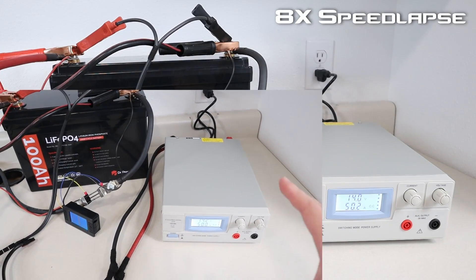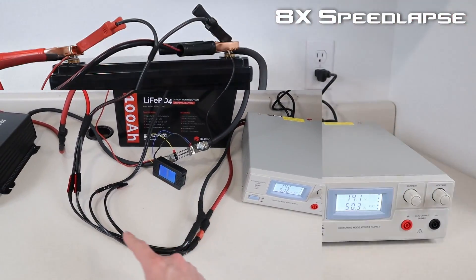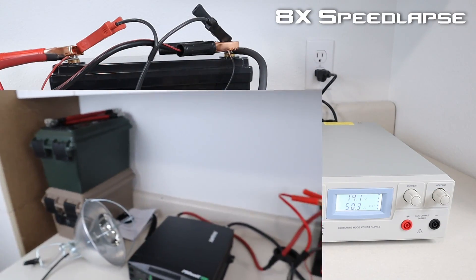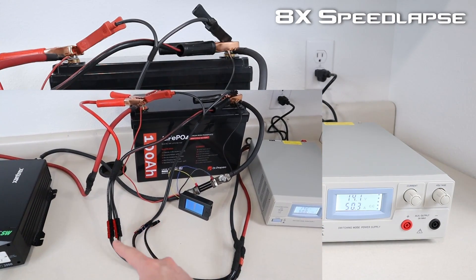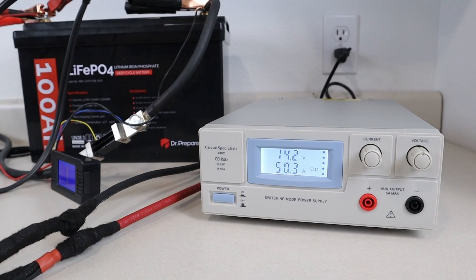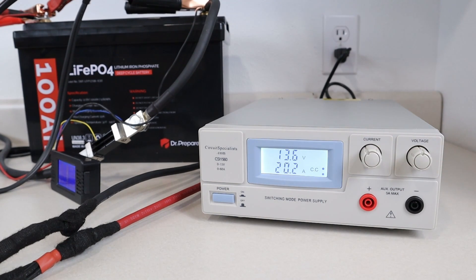You may be wondering what this wiring mess is. I have two 6 AWG cables which come into four sets of 12 AWG cables, and I have this charging cable because I charge up my other battery box — that one has four sets of Anderson power pole connectors on top, and I've come up with some alligator clamps that hook into those connectors so I'm able to charge this battery at 50 amps. It's been going for about 12 minutes, so I'm going to dial it back down to around 20 amps and let it charge there for a couple hours. Battery should fill up pretty quick.